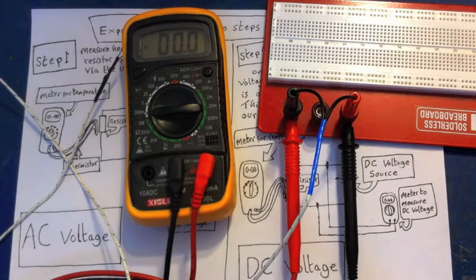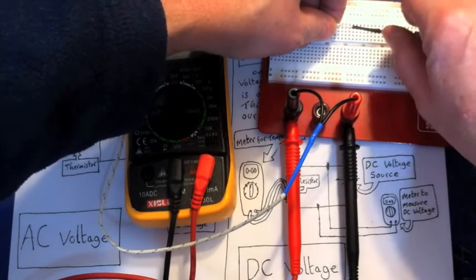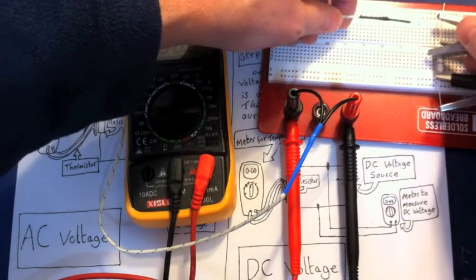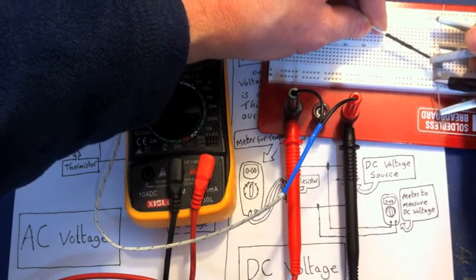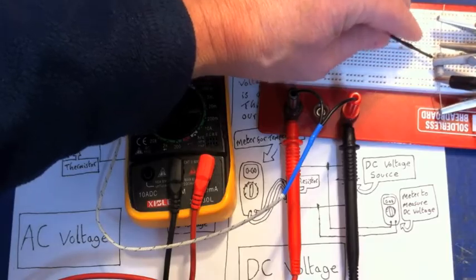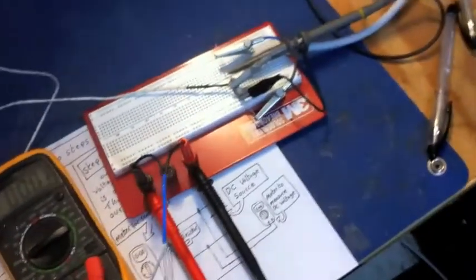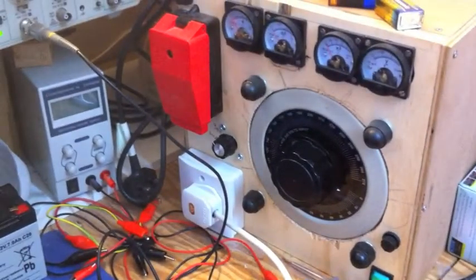So here is what we will do. First, make sure the thermistor is held as close to the resistor as possible — a small crocodile clip is perfect for this. I then connect between the other ends of the resistor an AC voltage. I'm going to use a variac and an isolation transformer to do this so that when I use a scope to measure the AC voltage, I can't blow the scope up. And never use a variac without an isolation transformer.